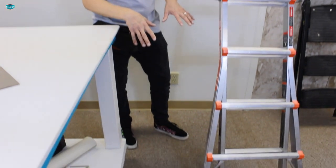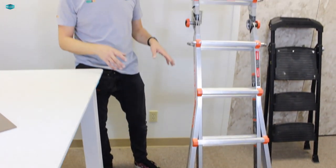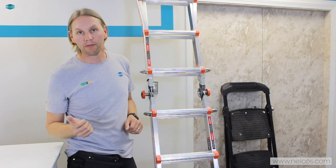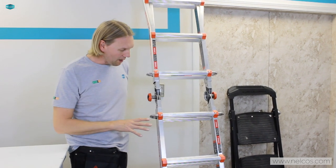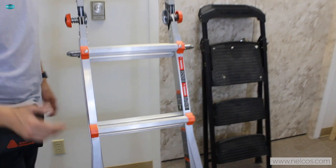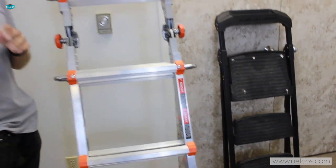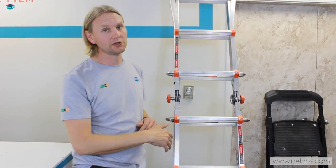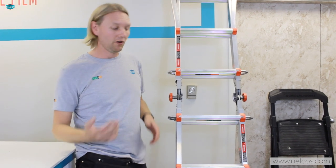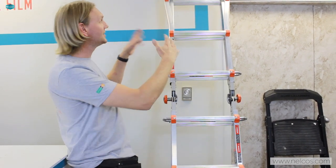You also want to make sure that when you're putting your ladder on the ground it's on a smooth, even surface. Even inside, make sure you don't have anything underneath the ladder like a piece of wood, a 2x4, or even paper backing, because that paper backing is very slippery. Every single ladder has to have the danger stickers on it — if there are no danger stickers, that ladder might be old and not up to code. If your ladder has any damage to it at all, don't use it. If you fall off a ladder it's going to hurt and it could potentially end your career or take you out for a long time.